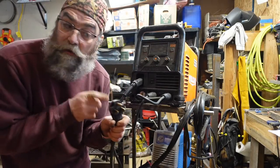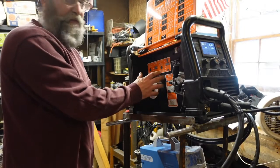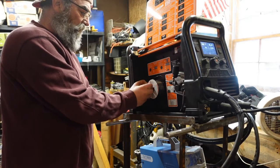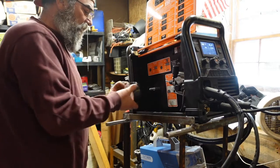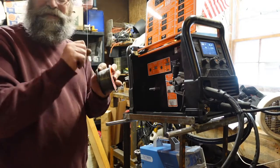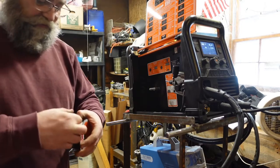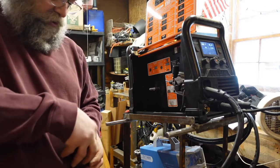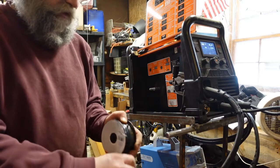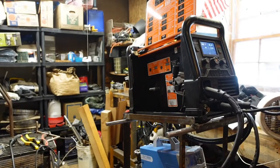I need to plug the machine in for that. We did put in a 220 outlet just for the welder and now for the plasma cutter — it's under my bench. We're going to cut the old wire and take it out. This is the flux core wire — we're going to take that spool out. We're going to make sure that this is crimped in there, because otherwise it comes around and makes a mess. If you let this unspool then it's ruined, so we're just going to tape it around there to hold it on. This is a brand new spool of flux core — I just put it on like yesterday — so I don't want to lose it. I taped it up. That's going to stay on there good.